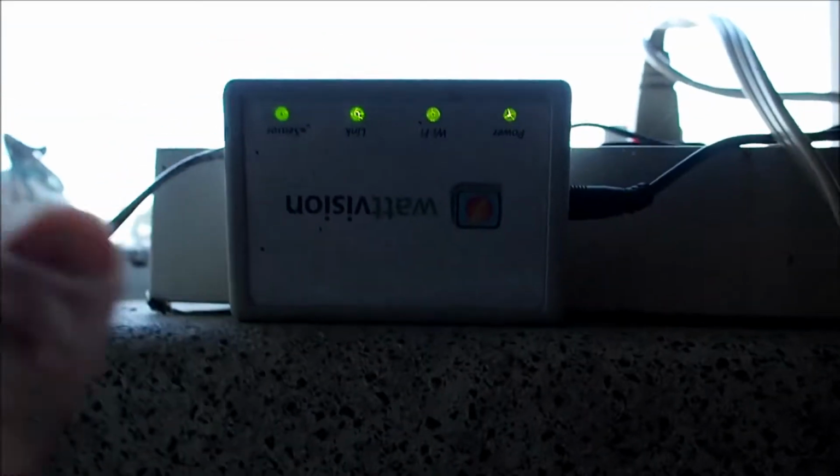Okay, so out in the garage, that wire comes from over there to this little box from a company called Watt Vision. It counts the frequency of the sensor LED on and off, so that's what that light does, and converts it into energy and sends that data to the cloud. We tap into that with some Mr. House code, so I can show you.